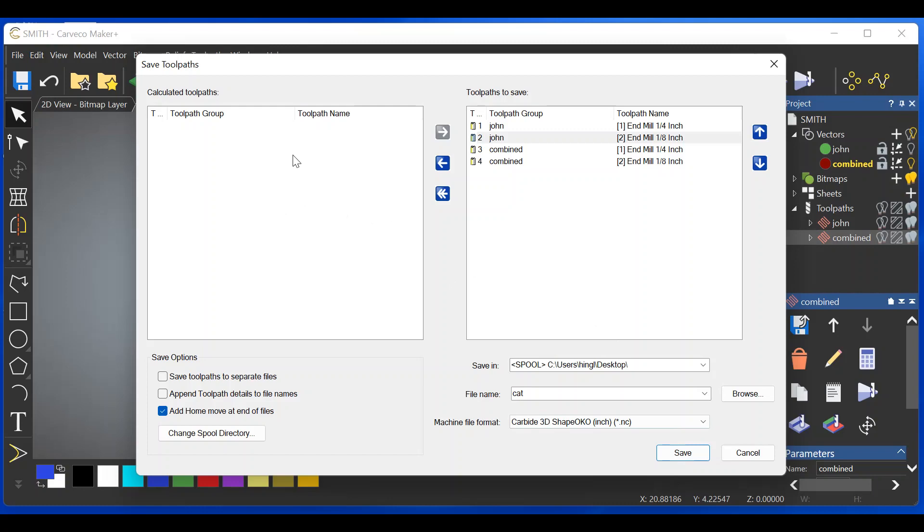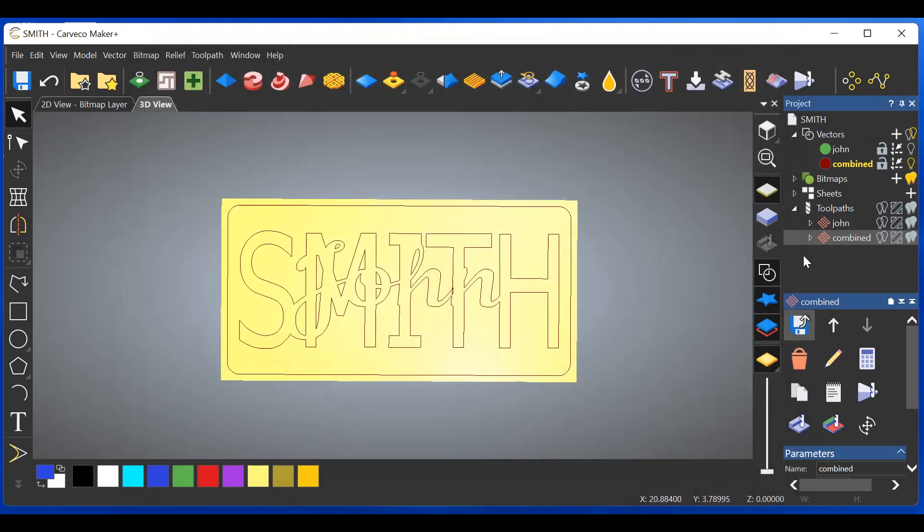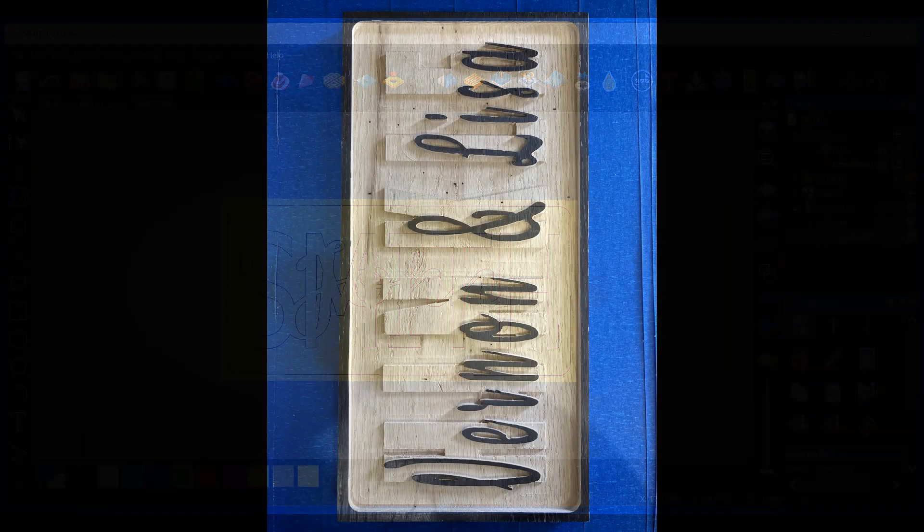If you have a bit setter or Pwn CNC's collars, rearrange the toolpaths so tool number one is used first, tool number two second, number three and number four. Give it a name and hit Save, then go out to the mill and run the tools. As always I hope you got something out of this video, learned something, and that it took away some confusion. If it did, give us a like, subscribe to the channel if you haven't already, and we'll catch you on the next one.